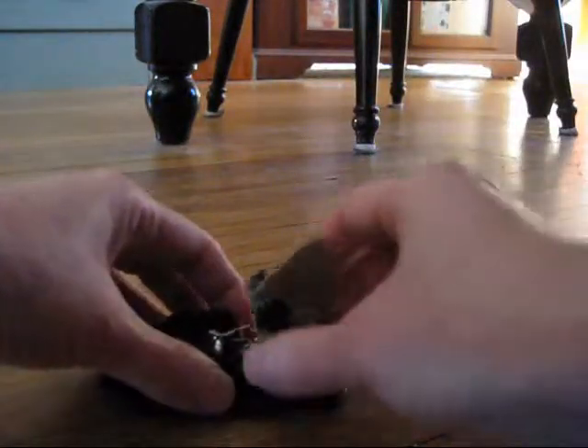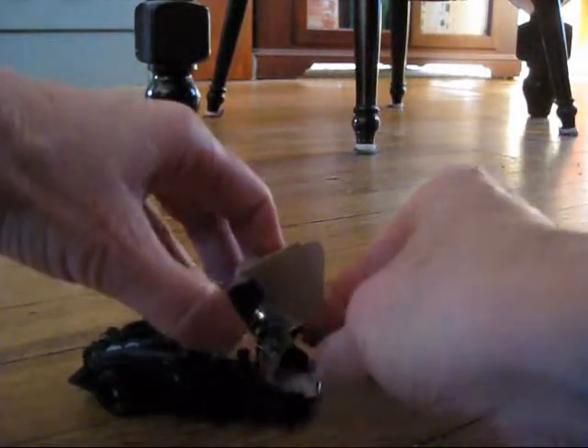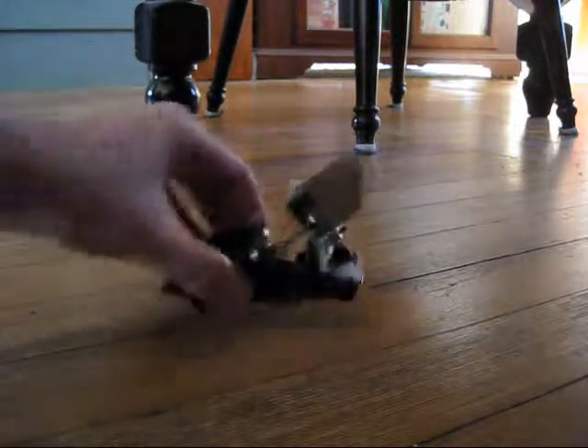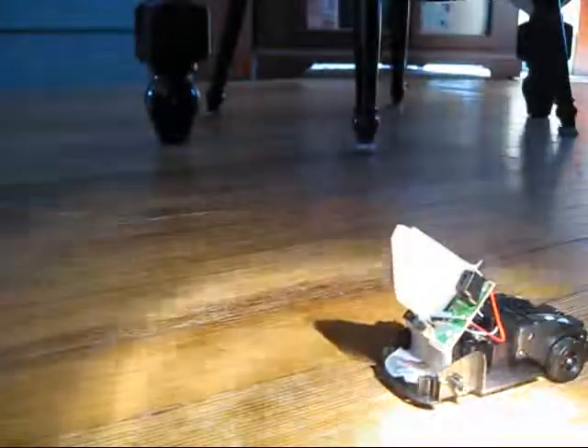Okay, so now let's see what happens. Get the sensor set up here. Now when I shine a light on the left sensor, our vehicle is going towards light instead of away from it. That's all that's involved in making a light-avoiding or light-seeking robot — it's just which motor is powered. I think that's pretty cool.